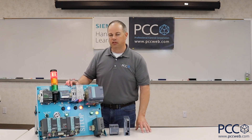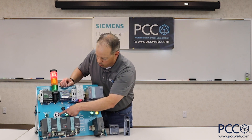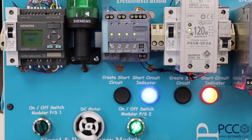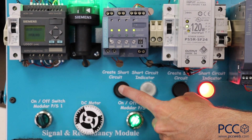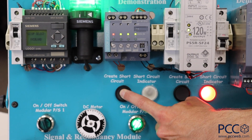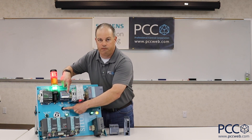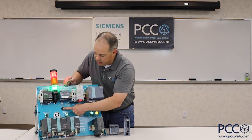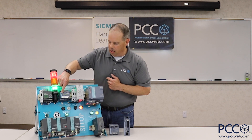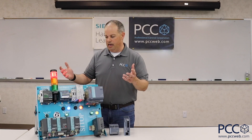So that brings in the value of the Siemens electronic diagnostic module, which would be wired on the output side of the power supply. I have a 24 volt DC motor running off a power supply through this diagnostic module, and now I'm going to induce a short circuit on this particular output. I press that button, induce the short circuit, and I get immediate indication on that diagnostic module of the specific circuit that has the problem — while the rest of my circuits stay live with 24 volt DC power, as indicated by these green lights. When I release the button, the fault clears, I can see my red light flashing, and I press the button on the front of this unit to reset the circuit. My short circuit is repaired and everything is back up and running.